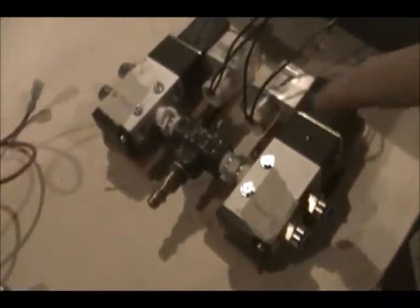This is a four-way five-port. Basically you can see here — one, two, three, four, five ports. We're going to say that this is normally open and this one is normally closed. So without this being energized, air is going to be pushing in here — let's say retracting the air cylinder. When this is energized, this pathway closes, allows the air in the cylinder to exhaust out here, and at the same time this pathway opens, pushing air in, which helps to exhaust this air. And then when it's de-energized, this switches back over, and the air going in helps to exhaust the air in the cylinder out here.